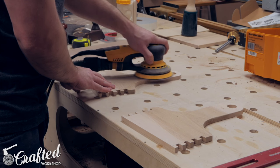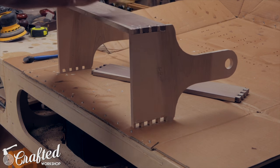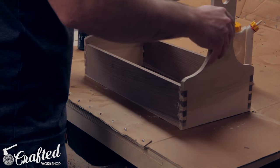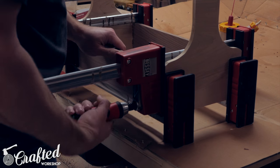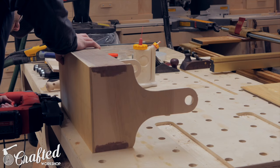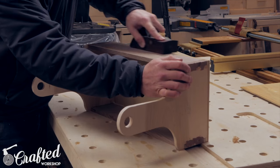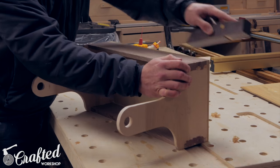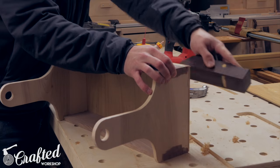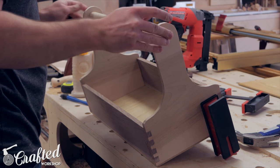With the sides shaped I separated them, sanded all the inside surfaces up to 120 grit, and then glued the sides together. Since this was my first time gluing together a box with dovetail corners, it took a little trial and error to get the order of assembly right, but I eventually got everything clamped up. Next I cut the bottom to size from quarter-inch Luan plywood and glued and brad nailed it on. I flushed up the bottom to the sides with a block plane and also chamfered the bottom edges. Then I glued in the handle, which is just a one-inch hardwood dowel — poplar — from the home center.